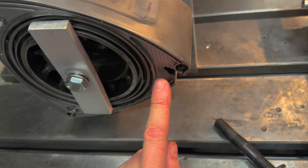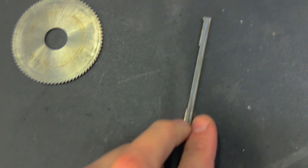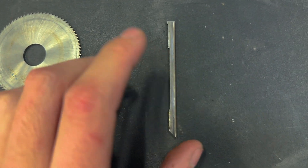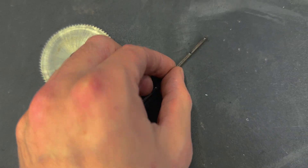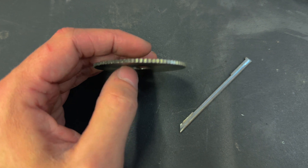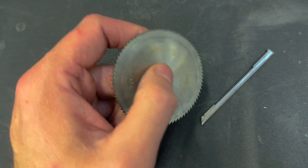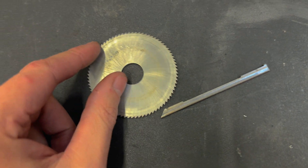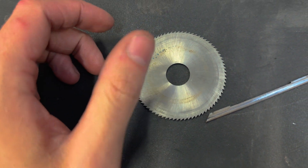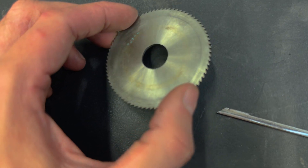That's a bit too deep but it was nice to find out. I ended up measuring what the slot is by using the apex seal with a 0.1 feeler gauge and you get your sort of tolerance. At the moment the slot is just above bottom limit tolerance - it measures at basically 1.998 millimeters. The slitting saw ranges from 1.98 something to 1.998, so I should just be able to use the slitting saw and get the perfect tolerance for the apex seal.